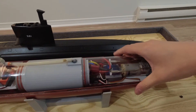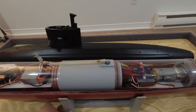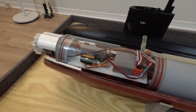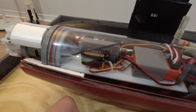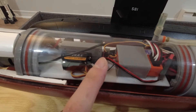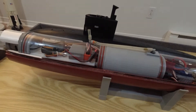The boat is powered on right now — you might hear the servos jittering. To reduce noise, I've fitted capacitors to both the main motor at the back and the pump motor at the front. I still get a slight bit of interference, but nothing to cause major disturbances. I've also fitted a ferrite bead around the servo cable. It's mainly the ballast tank servo that jitters occasionally; the rest are fine.